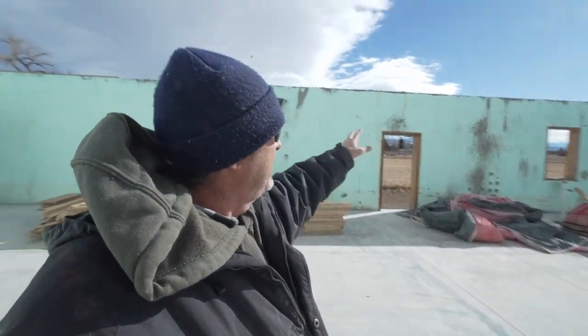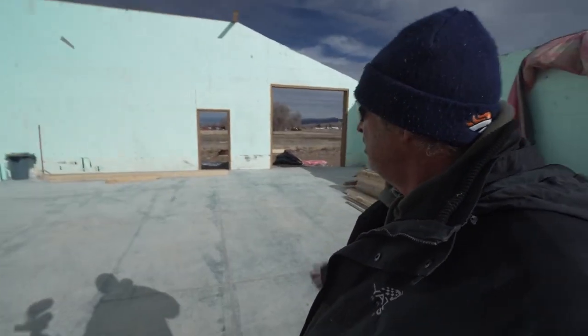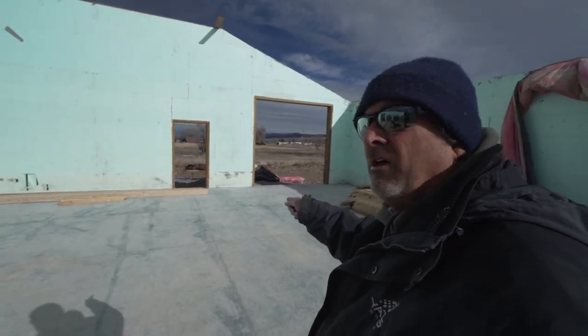Well, this morning, we've successfully gotten some positive numbers here. I'm roughly 1/4 inch too narrow on this wall, but I have a little bit of room over there to make the trusses go a quarter inch that way. So it's all good. This side is perfect, within an eighth of an inch. That's really good. So I'm going to start building this wall here.